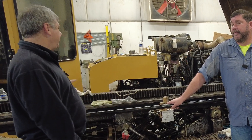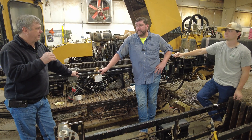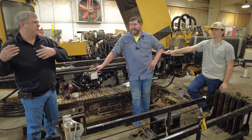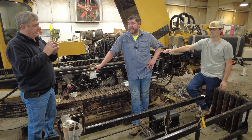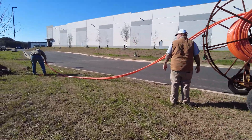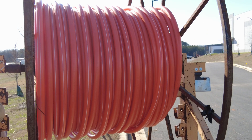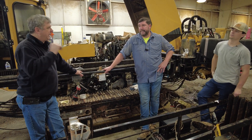It's a good production machine because it's got the 15-foot rods. It's a big machine — a 3650 — and most people would be pulling back 8 to 10-inch products with it, but we're only pulling back 1.25-inch. We're essentially displacement drillers: we're not bringing a lot of soil and mud back. We drill the hole and basically compress the soil out of the way just to get the width of the drill stem and the head — a 5-inch hole — and then we only need a 3-inch hole to get the duct back, since we're typically only pulling back two ducts. We'll also drill for other people doing 4, 6, and 8-inch work.